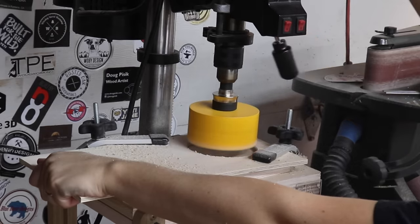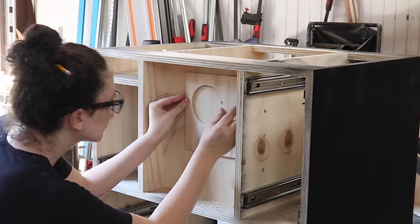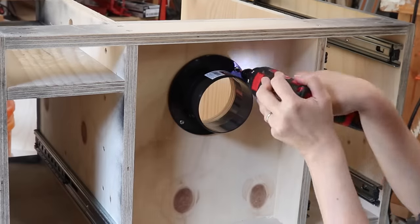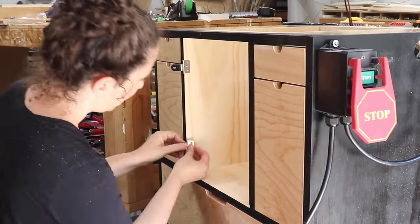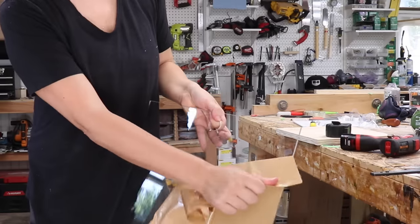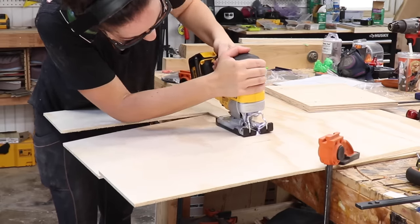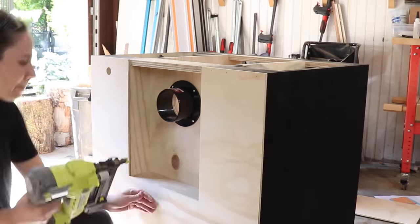The dust part needs a four inch hole. I hate using the hole saw freehand so I first made a four inch hole on quarter inch plywood at the drill press and used that as a template with double-sided tape and a flush trim bit from the inside to complete the hole. More steps for sure, but easier and cleaner — though no one's ever going to see it because it gets covered up with a four inch flange inlet from Woodcraft. Then the start-stop switch gets screwed onto the side. I screwed the hinges in place, drilled corresponding holes in a piece of acrylic for those hinges and drilled another larger hole as a handle, and screwed the door in place. I noticed it wasn't stopping where it was supposed to so I added a small scrap as a stopper using CA glue.